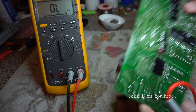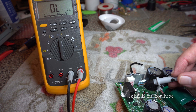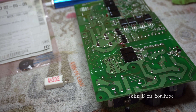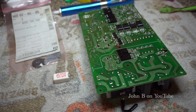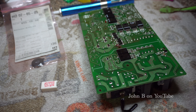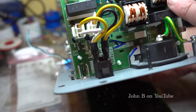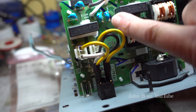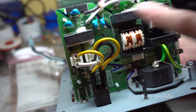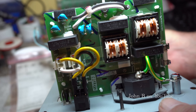So I've got to now order this 5 watt, 6.8 ohm resistor. You can see it runs at up to 142 degrees C. Try and get one of these from somewhere and hopefully that's all it is. So more information on this resistor — what I didn't see on the main circuit. You've got capacitors, these coils, common mode chokes. I think these are possibly transient suppressors — anyway, these are to suppress noise on the mains, stop it coming back out of the amplifier. But there's no inrush suppressor, so let me show you what that is.